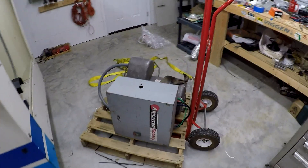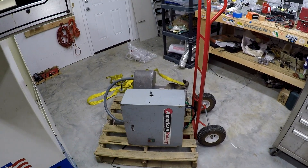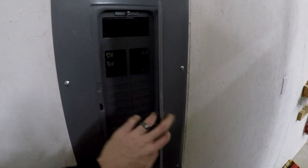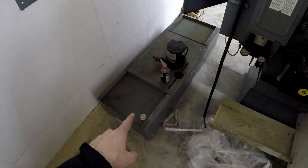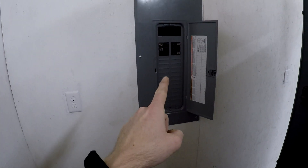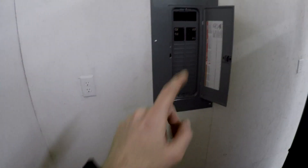Here it is. I'm going to open it up real quick — I got a few screws to undo. We'll take a look inside and then figure out how best to place this. I'm thinking over here, back on the corner — I might put it either on that wall or on this one over here. You can see here's the panel back here. I'm probably going to mount it over here. I've got to run conduit — this is also a really short distance — so I've got to get a breaker eventually when I get it mounted, everything set up. Breaker, get conduit to come around, go to the wall unit, and then from there probably up and around because I don't want to have coolant get things wet.